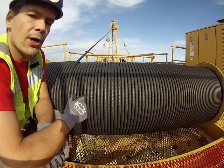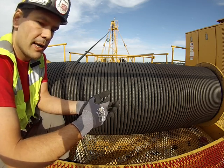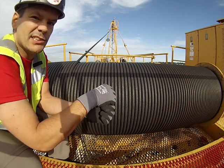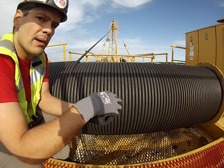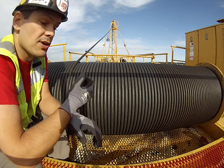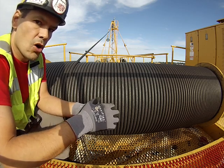What comes to mind is a bird cage I saw once on a crane that was only nine months old. There are three layers of rope, and the outer layer had expanded — we call that a bird cage, imagine it all blowing up. It had worked itself all the way back to the very end of the drum, and you couldn't see it unless the hook was all the way down to the ground. The operator had never seen it, and the rope was shot because that outer layer isn't supporting any load when it's bird-caged out.